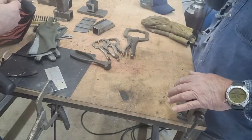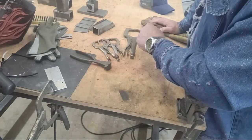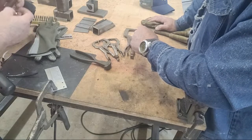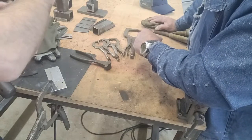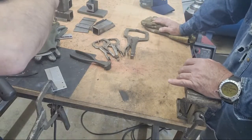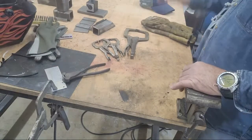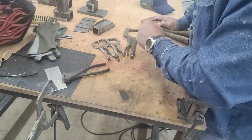That's one thing about welding — it doesn't matter who you are or how well you do it, you're going to run into problems. This stuff happens constantly. Toga is asking what type of NDT — non-destructive testing — do you use primarily on the helicopters? We use all kinds: dye penetrant, the whole gamut. We use a lot of Magnaflux. Toga is studying aviation in Iowa. We use X-ray and ultrasonic especially for welding.